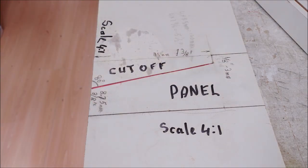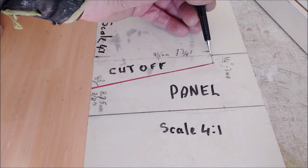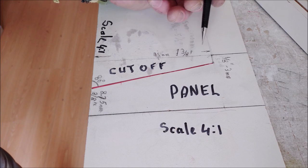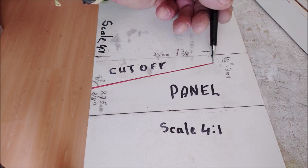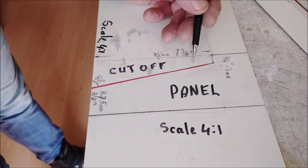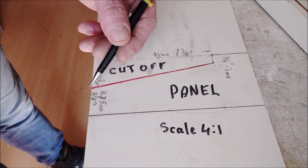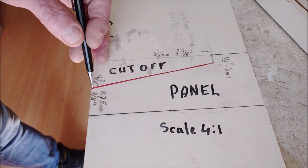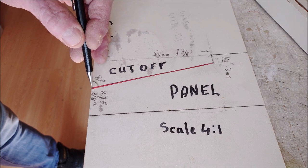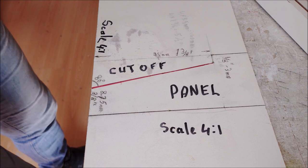So this is merely an example. This is the panel — this is the edge you put in your frame, and this is the cutoff, and here we have the shoulder. We want to make it 1-3/8 of an inch high — that's here on the wood. I want to go 1/8 of an inch inside for the shoulder, so I get a fixed point. Now I only have to determine the angle, and I want this to be 3/8 of an inch — what you stick in your frame. So the only thing you have to do is from here to here measure 3/8 of an inch and put the point in.